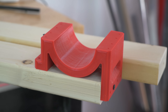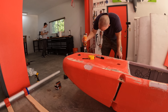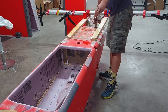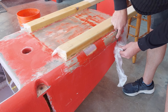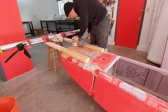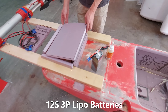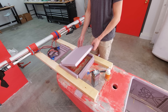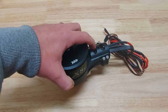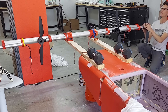The aluminum motor mounting tube would be clamped to 2x4 standoffs. The 2x4s were initially attached with Gorilla Glue; I then came back later and fiberglassed everything together. These batteries were powering really cool Hobbywing motors that have field oriented control speed controllers built in, which made wiring and assembly incredibly easy.